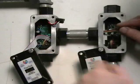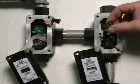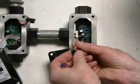Once the cables have been pulled through the conduit, terminate the wires with the 5-pin terminal block supplied. Make sure the wires are secure by giving them a light tug. Then plug them into the 5-pin socket inside the housing.